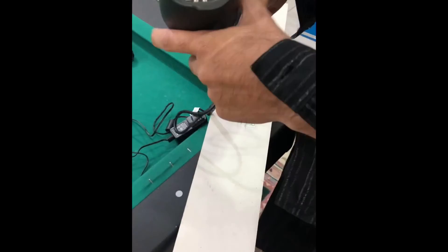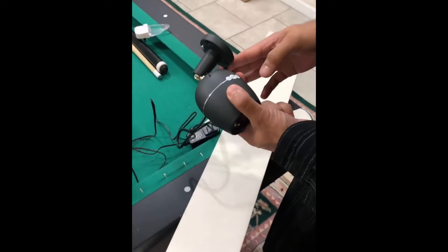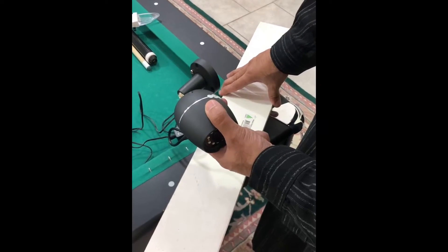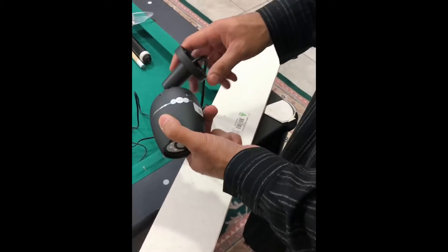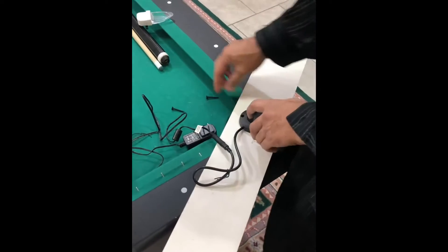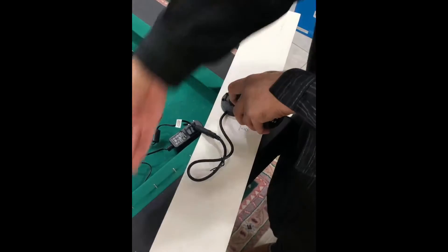I'm going to go ahead and install the camera now. I want to install it on the side, but it's just sheetrock there, so I want to put it on something more solid. I'm going to apply it to this piece of wood so I can screw it into studs — it's just not floating on sheetrock. It's going to be a more solid installation. It comes with screws, so I'm just going to go directly into this area which I have marked off already.